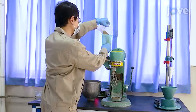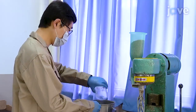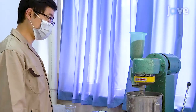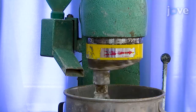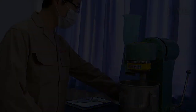To make the mortar, first add sand to the mixer's sand holder. Then put water into the mixer. Next, add the cement. Let the water and cement mix for 30 seconds. Start the slow, automated addition of sand and continue mixing over another 30 seconds. Mix for 60 seconds longer before stopping.